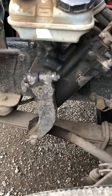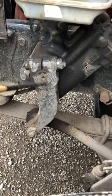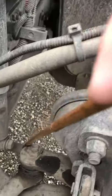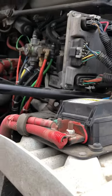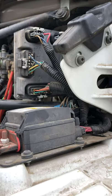From there, we're going to go into the steering linkage system, which is divided into five parts: the pitman arm, the drag link, the upper control arm, the lower control arm, and the tie rod. Make sure all five parts are securely mounted with no cracks, no bends, no illegal welds, and properly secured with a castle nut and a cotter pin. Then we check our electrical wire system — make sure the wires are properly secured with no cuts, no frays, and no copper wires showing.